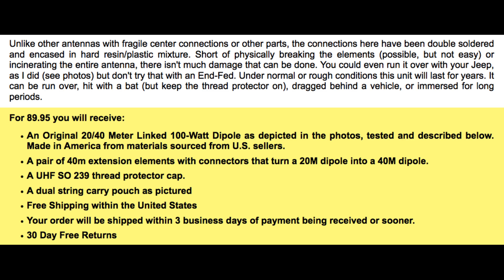The fact that the antenna was resonant meant I did not need to pack a tuner for use with my tunerless rig. The 20-40-meter, 100-watt linked dipole sells for $89. Tim also sells a QRP version for a lower price. When purchasing antennas that offer QRP and 100-watt versions, I always opt for the 100-watt model — that way I never have to worry about damaging an antenna by applying higher power.